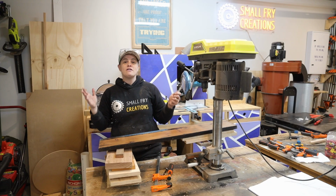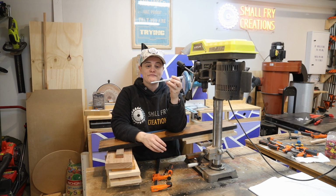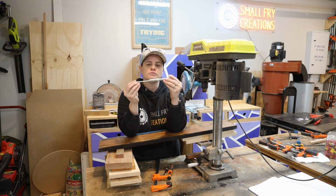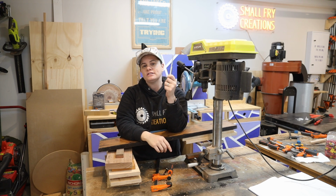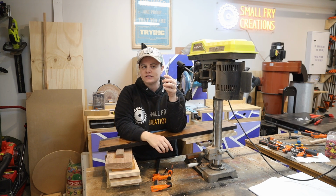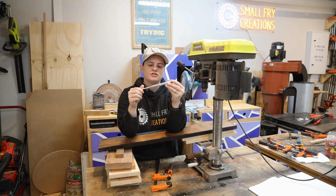We're up to the part where we're finally going to mount these shelves onto the wall, and my hardware has turned up from Amazon. I'll leave links in the description below for you. One end has a coach style screw which screws into a stud on the wall. That is a downside of this hardware, but having such a long shelf means it's going to be really easy for us to find 2 studs.